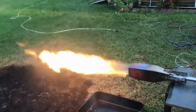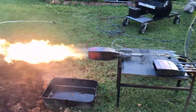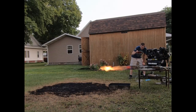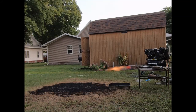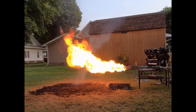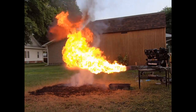You can go really lean with the mixture and get a very, very hot flame. This flame can be burned all the way down to a blue color. But I know you guys probably have low NOx requirements, so I'm not even going to bother messing with it at those high temps because you guys will probably never use it in those conditions due to NOx regulations. For the most part, this thing can go as high as 3.6 megawatts — that's what we've maxed out here in the video.